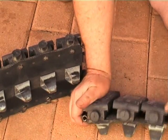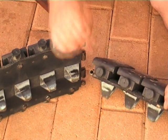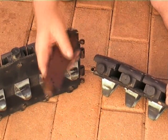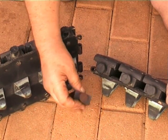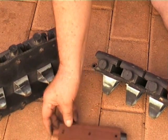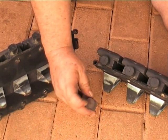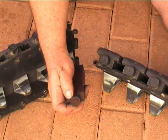You can see the individual track pads. The first part we have is the main core. This is made from jarrah or any hardwood, which has been turned out on a jig that turns out the ends for a 19mm diameter, with a poly tube ring fitted over to that.